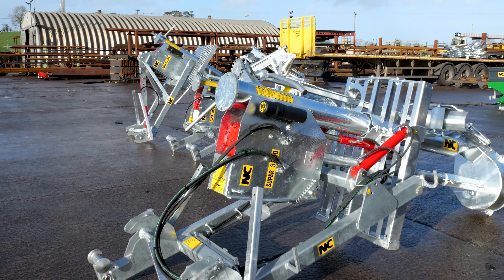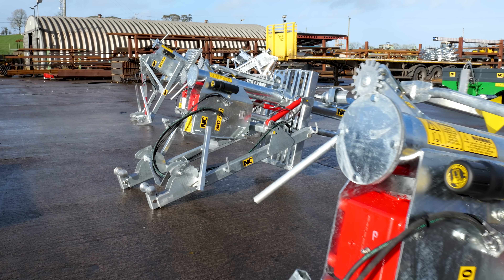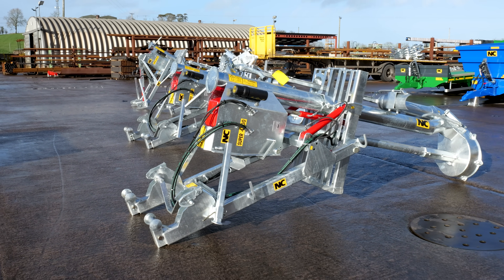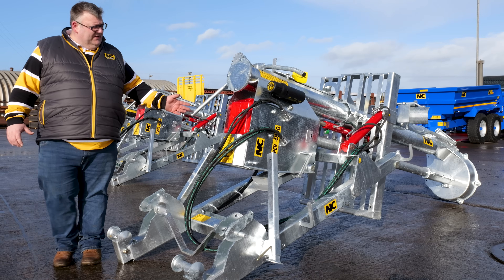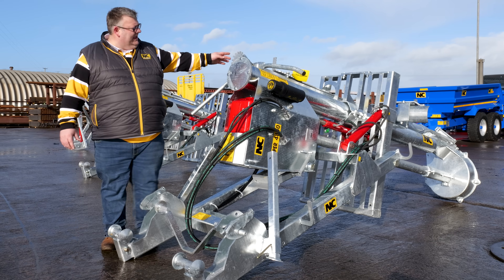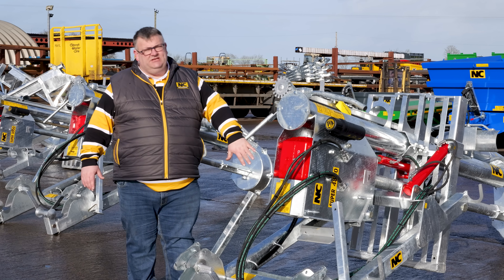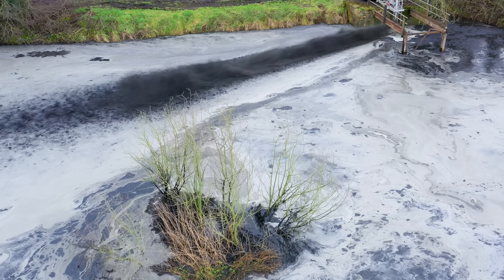Sizes on the 3800 and the 4800 are six foot six, seven foot six, eight foot, and nine foot. When you go any bigger than that, you have problems with the geometry at the back of the tractor and they're prone to taking rear windows out of tractors. You can have hydraulic rotation and hydraulic angling on your nozzle. Mix-to-fill is the same — pull down your valve, change it over, and you can pump between tanks or pump to your tankers.